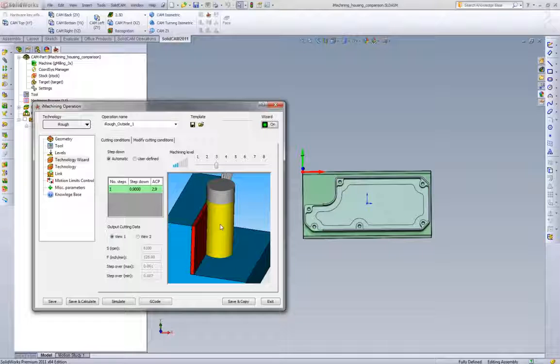This is because now we're doing full depth of cut, so we want to shorten up the width of cut, so that way we're not getting into a heat condition. When we're also doing this, we're going to adjust the feed rate for chip thinning, so we're running a constant chip thickness. Now, if we look, iMachining does some different things than what we do in standard pocketing. When we're using carbide end mills, we're going to try and hold 2 thou and 7/10 of a chip thickness.